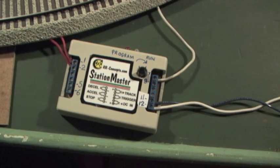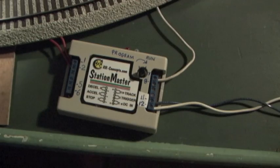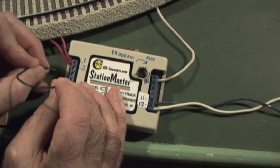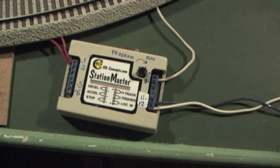The instructions — I've got the instruction sheet here in front of me — are: close terminals three and four, again using either a magnet on the center or a wire, and I'm going to use the wire again. Close terminals three and four and you count the blinks — one blink equals one lap, which is what it's been operating at. If we do two blinks, that should give us two laps, which is what I'm going to hopefully demonstrate. I made it blink twice before I released the wires from the terminals, and it echoed back two blinks, so it should be set for two laps.